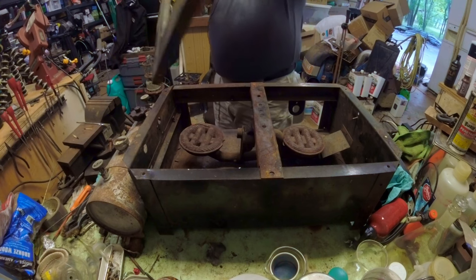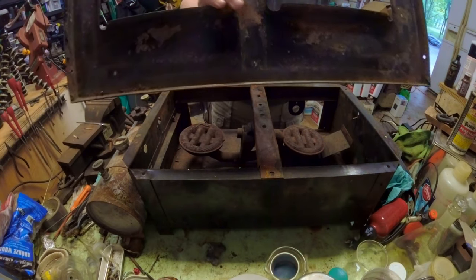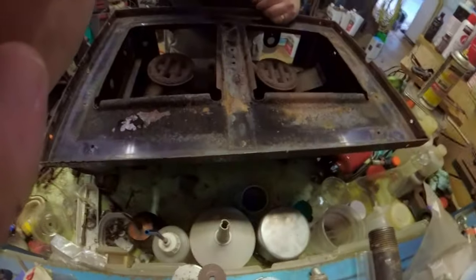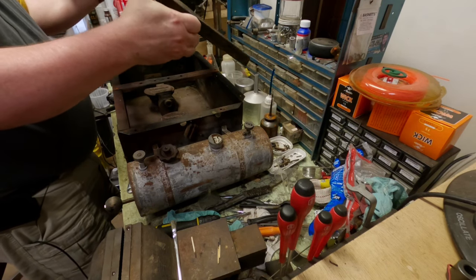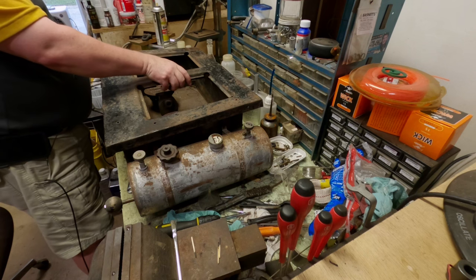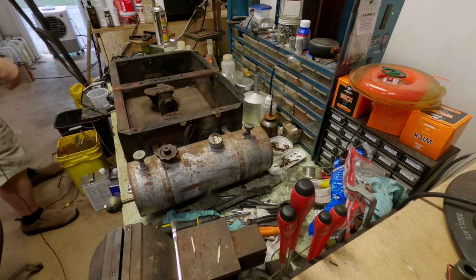This is great — I was very concerned about this Aero Gas plate. You can see it's got what look like rivets but they're actually little brads — just two little tabs folded over here and here, so I can unfold those and put them right back without any drilling. The main reason I want to take it off is that I don't want this brass piece in the electrolytic bath. I'm not exactly sure what would happen to it and I really don't want to find out.